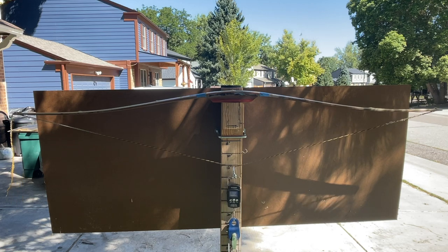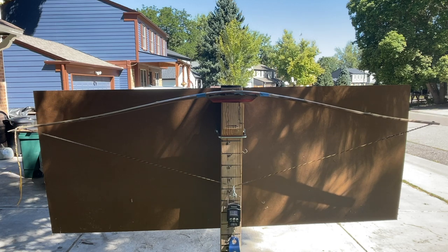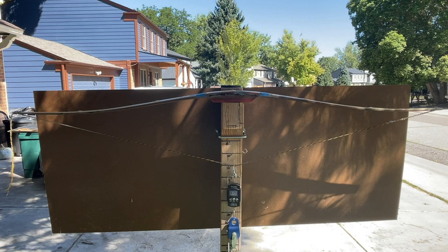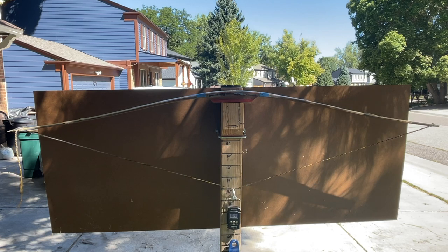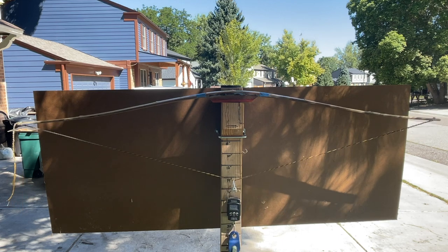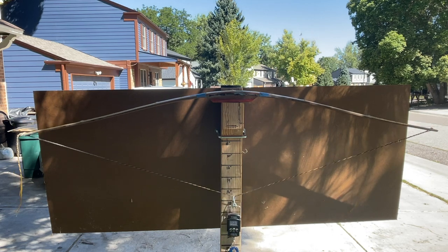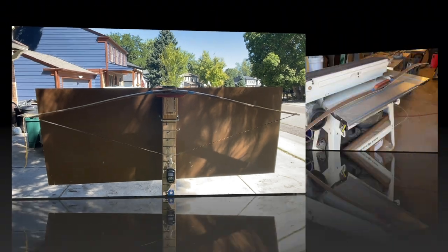So since those limbs were glued in, or were generated in straight lines, like those pieces of wood were straight before we glued them up, the only difference going on right now is the fact that we're working a shear line, being the glue line between the bamboo and the ipe. When we pull it straight, when the limbs become straight, the wood pieces themselves are just back to their original shape before we glued them up, if that makes sense. So really there shouldn't be any actual strain on the belly or on the back, and where we're storing energy right now is on that glue line.